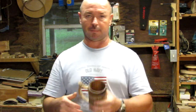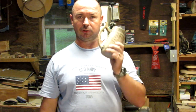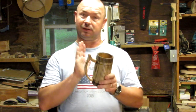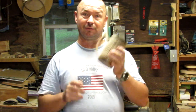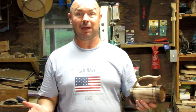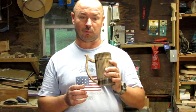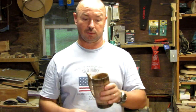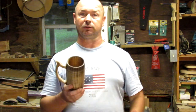But anyway, I hope y'all enjoyed this. But make sure, if you decide that you want to make these for people or for yourself or whatever, water is wood's worst enemy. These things cannot go in a dishwasher. They cannot go in a microwave. Don't even put them in the sink that maybe has water in it to await being washed. When you get ready to wash them, you wash them in warm soapy water, rinse them off, and dry them right then, and set them up so they can air dry, and they'll be ready to use the next time. So try to remember that.